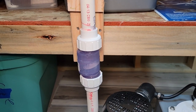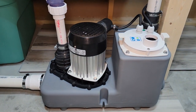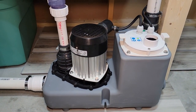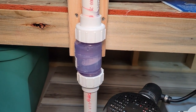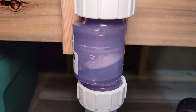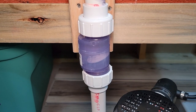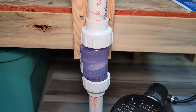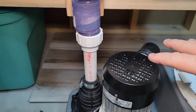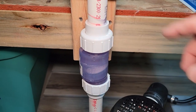Here I've got the one inch quiet check valve installed. It works really well, which I'm going to show you. I got the Sani Flow hooked up to a kitchen sink in the basement and it's going to kick on here in a minute. Right now it's closed — it's preventing the water from going back, and it does a good job. I really like these clear ones; you can kind of see what's going on. I like that it's a union, so if I ever have to work on this, I can take these off and I'm not having to break a glued connection or anything.